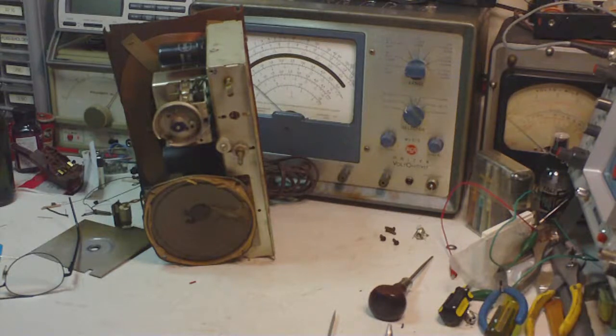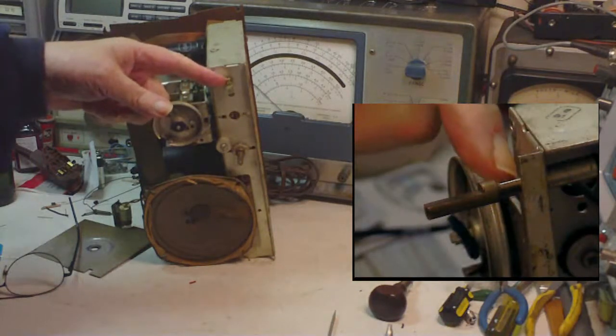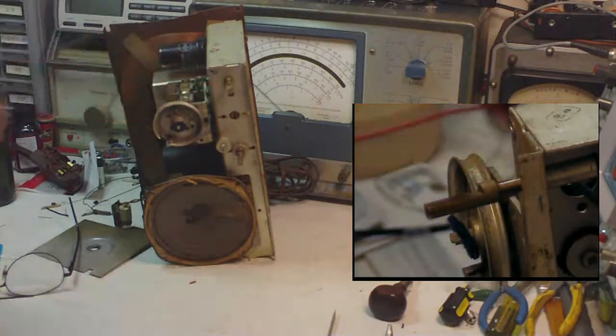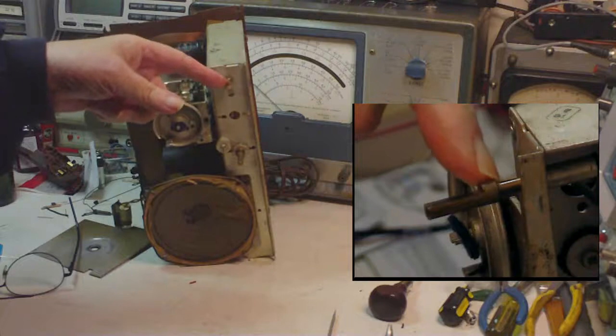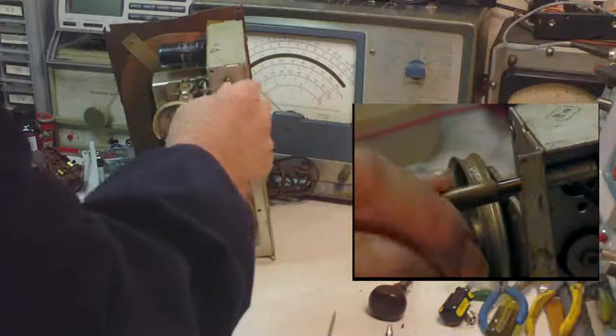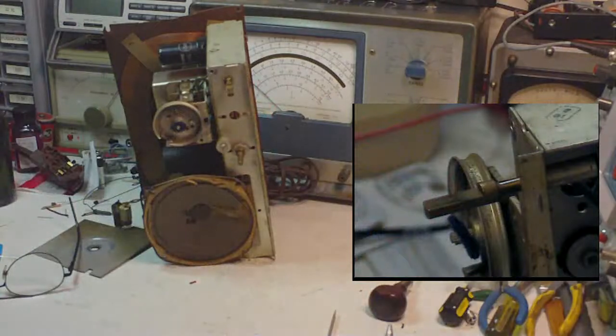Speaker Freak 95 emailed me this morning and is having a problem with a slippery dial cord. And I've been meaning to mention this for a little while. What can happen, I took the dial cord off of this, is right here, if this radio gets used quite a bit, this can get very, very polished and smooth right here. And even though you have the right tension, it can get so smooth that the dial cord will slip.